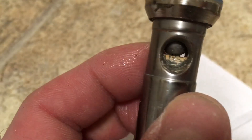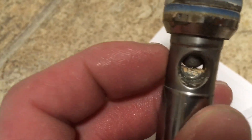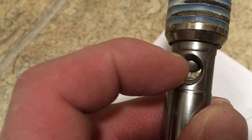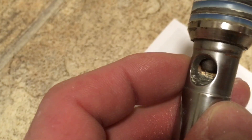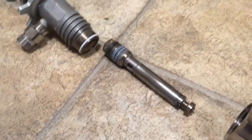I think I've identified the problem, which was crud gathered in here, which I have mostly cleaned out. I'm going to scratch away at that some more, but it was a little chunk of something just there next to the ball which I've cleared, and I'm pretty confident that this tube down to it is also clear. I think I've fixed the problem that was making the pump not work and not push paint through.